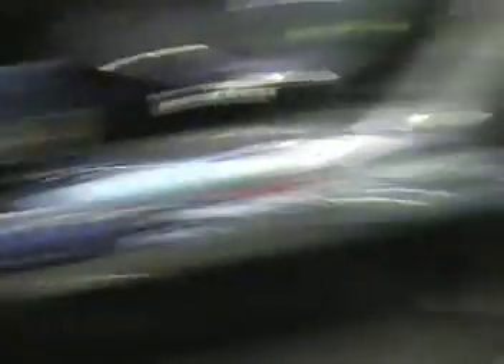Obviously cutting out here — this is all waste material. This will be cut and bent round this pipe as much as possible, and the same on the front here. But as you can see from underneath, it's virtually touching here and I've got a nice gap here. So basically this bracket needs to be made a little bit higher and longer so that this will pick up a little bit higher.